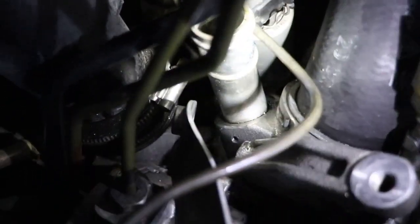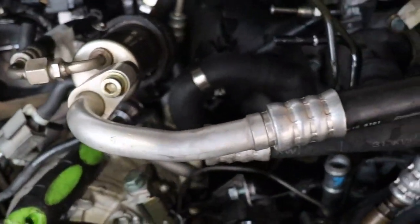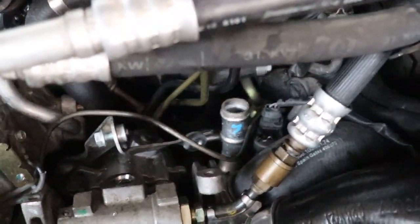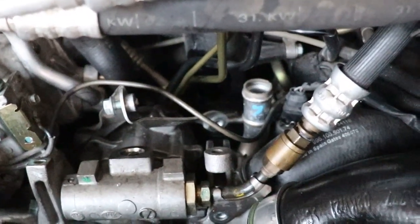Okay, number seven here is drilled and tapped, as you can see. And I'm going to pull out the wire here. See if I can grab that wire. And those are my little bits of shavings on that. See a little bit? Right. Not much went in there, but we wanted to pull that out so it's not circulating through our cooling system. Now all I would do is put the screw in and put a little bit of additional adhesive around as a little fillet around the edge.